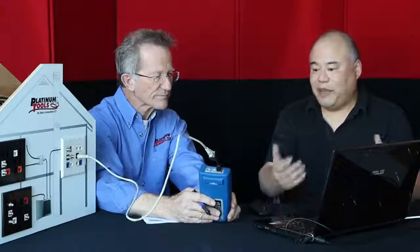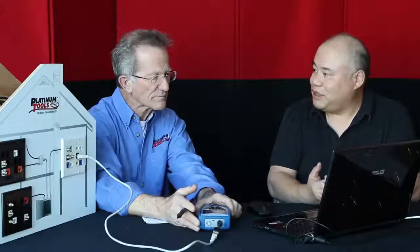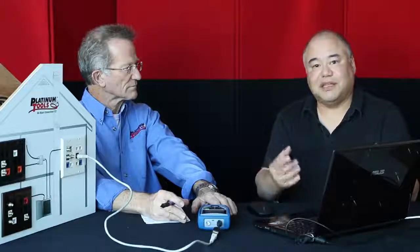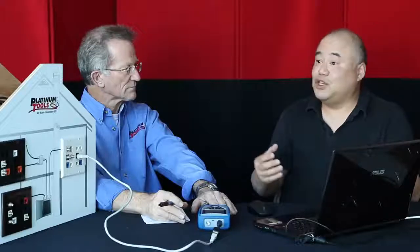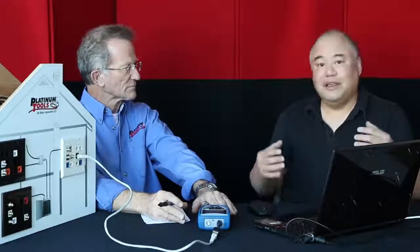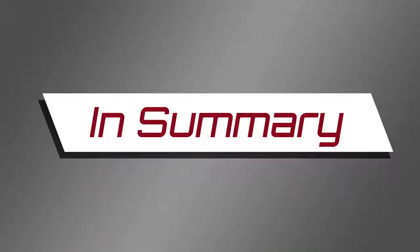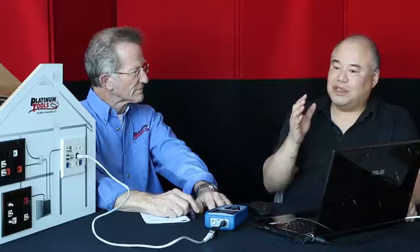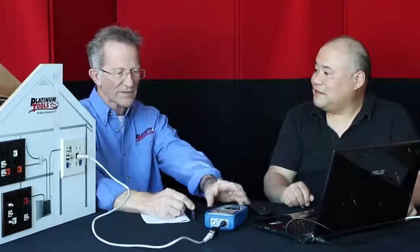Wow. You know, as a whole package, it's an excellent solution. First of all, you have your standard cable testing capabilities. You can also do port testing capabilities to see if you're set up for same connectivity, whether it's 100 or a gigabit connection, and full or half duplex. You can check PoE voltages on the line if you're installing cameras and such to make sure you have enough voltage. It's a very complete solution if you're just wanting to test your cables, and then once you've tested your cables, you're checking your networks. Great. So that's the Net Prowler.